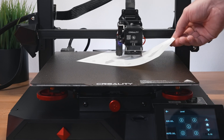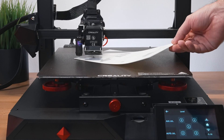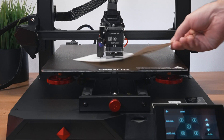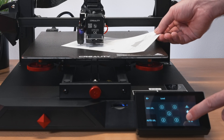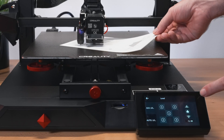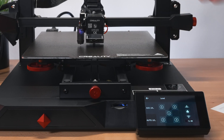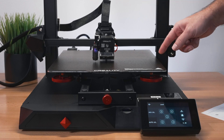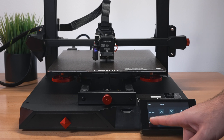Going to the center by clicking on point one, there's a little less drag. Using the Z-axis offset - already at negative 2.51 - we can go down from there. Getting it to negative 2.60 gives a slight drag, and now it's pretty much perfect all the way around. It will be a little tighter on the edges than the middle, but that's fine because the automatic bed leveling will measure everything and compensate.